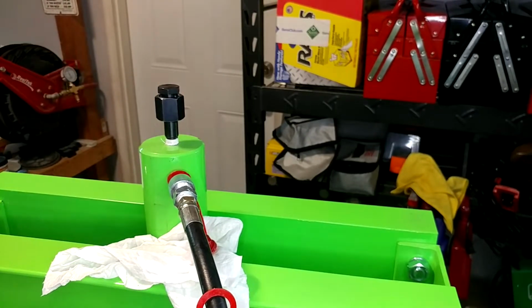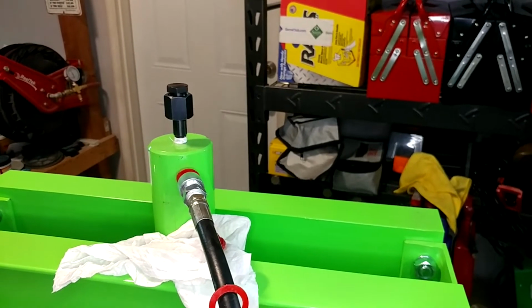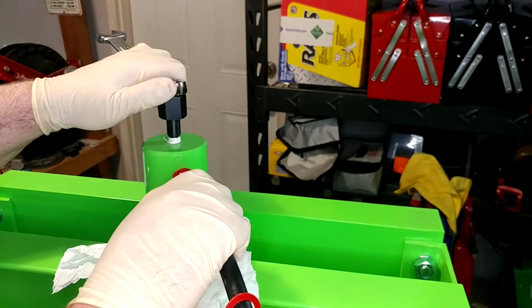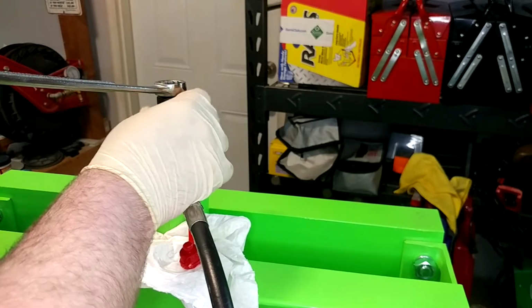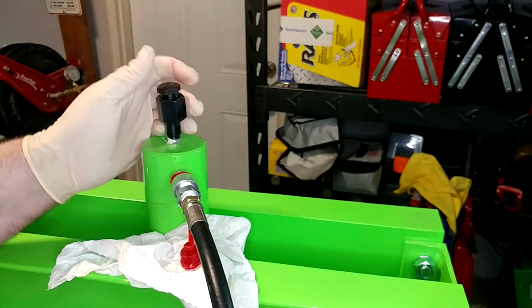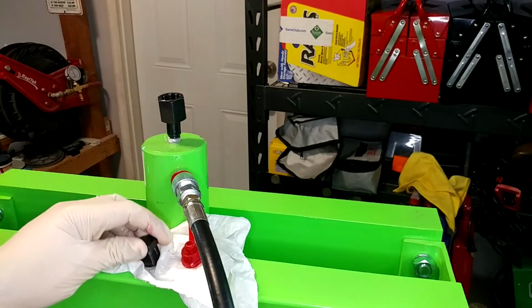It's giant. Oh, I should have mentioned that too. The big bolts and stuff are all 24 millimeter, so you're going to need wrenches, sockets, whatever, up to 1 inch or 24 millimeter to get that done. That guy is 22. Ugh. Okay, and that is immediately letting fluid out. It made vacuum noises. That must be why this is a real cap. Yeah, that's all wet with hydraulic oil.